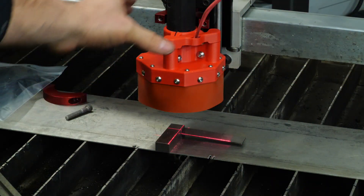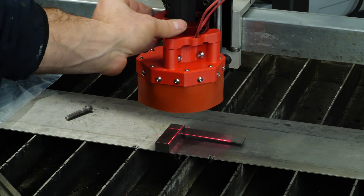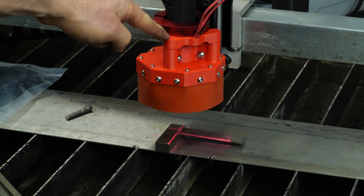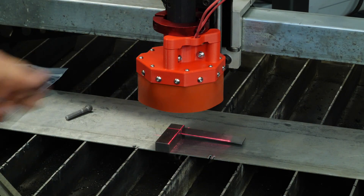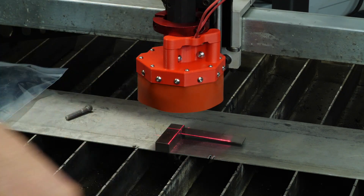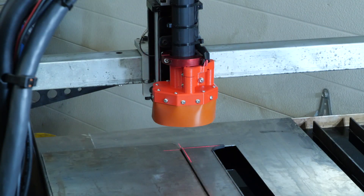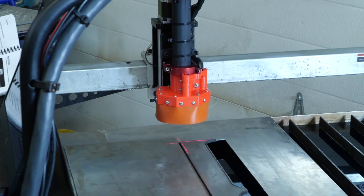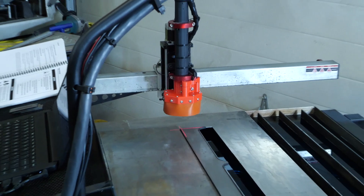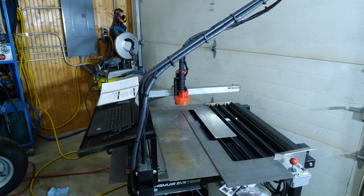The lasers are aligned, the shroud is tight on the torch, the lasers are tight. I have to put back the clamp which interferes with my decorative laser covers — this plastic piece for covering the tops of the lasers is completely optional, but I like it. Then neaten up the wiring real quick. We are preparing to make the first cut with the new torch shield and laser holder. The lasers are on and they're helping me find the corner, the work zero corner.